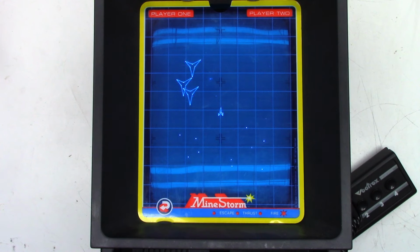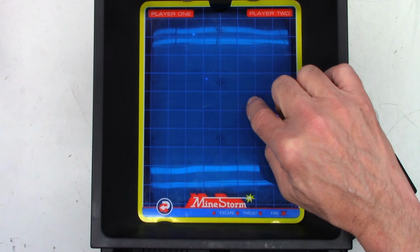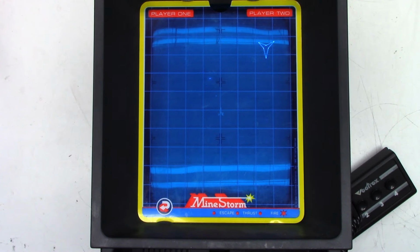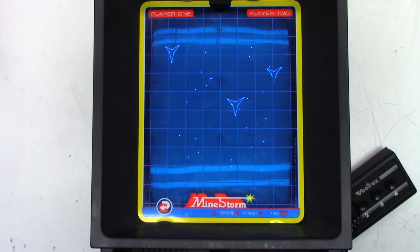This is not a standard cathode ray tube monitor. It is a vector display. So what it actually does is it draws each line and then it moves to there, turns the pixel on, moves to there, turns the pixel on. So it's what's called a vector display. Instead of just scanning, scanning, scanning, it's actually drawing each individual line with a horizontal and vertical amplifier instead of just one field, one field, one field. So pretty interesting. I remember, like I said, Tempest games use this in color. And previous to that, Asteroids used a vector display as well.